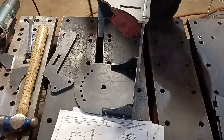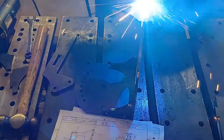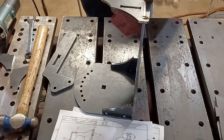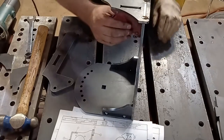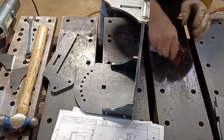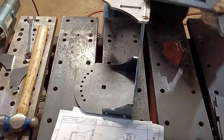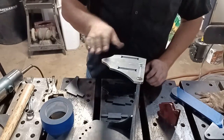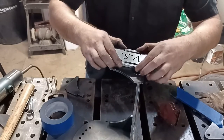And the other side. I've got two welds — that is solid. These are all just tacks; we're going to finish-weld the whole thing, but we can't do that right away. You're going to have to grind this one off — you can't leave it there because this slides in between. Now we're going to weld this part on.